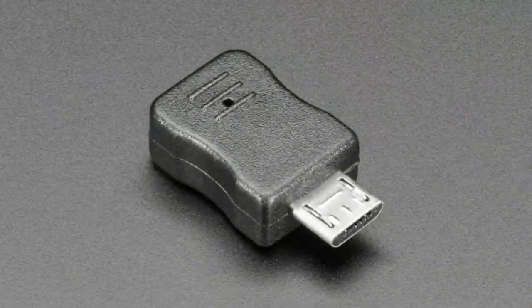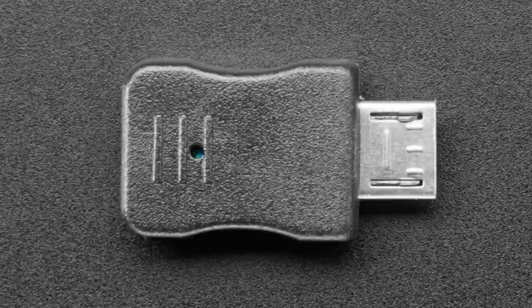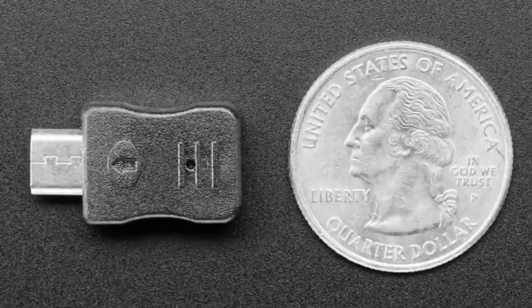Oh, this is kind of a weirdo thing. This is something somebody sent us, and I was like, well, I don't know how useful it is, but it might be useful. So I'll carry it because they're pretty cheap. This is called a jig, J-I-G. Traditionally, they're used for people who have Samsung phones with a micro USB on-the-go slot, and you would use this to get it into debug mode or bootloader mode. Even if it kind of seems bricked, this would usually resuscitate the phone.